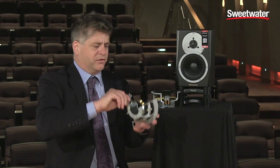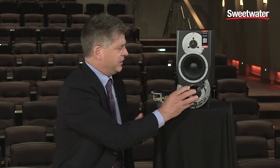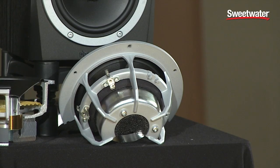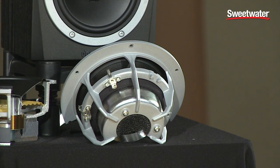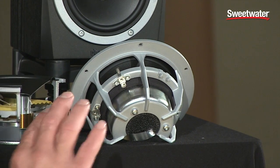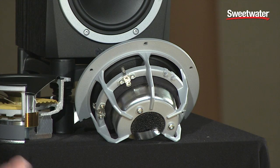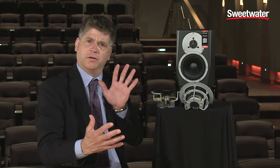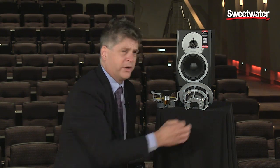Another aspect of driver design is the aluminum backing. As you can see, very thin aluminum ribs surround the cone at the back. In traditional speaker design, you may see formed steel plate that's been punched with holes, with a lot of mass behind that — and what happens is you get air compression as the speaker pulls back. With the Dynaudio drivers, because of these thin ribs, there is no air compression. The only compression happening is in the cabinet itself, which is tuned, and that's where you want it.